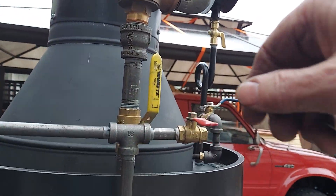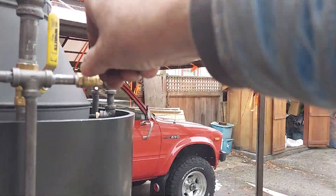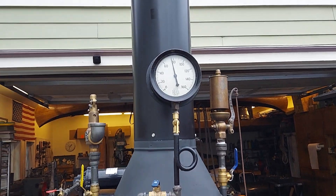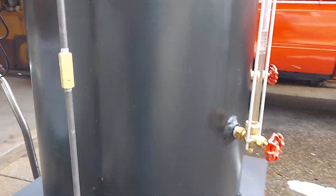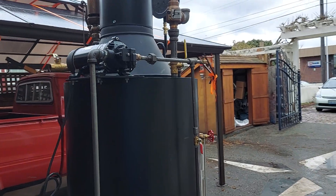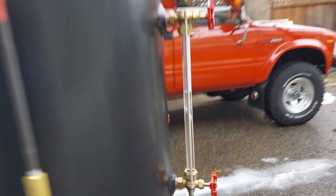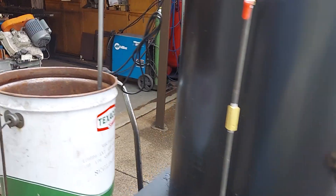This is your airlock valve. The water that goes out of there — it's amazing. It's pumping against 80 pounds of pressure; I've had it up to over 100 and it pumps just fine. It's pumping water into the boiler now. No more hand pumping — really works good. You just want to put enough water in to be right about halfway. I have a mark here on it right there, but it's been pumping well above that anyway.